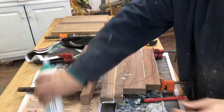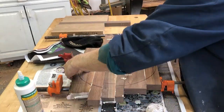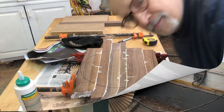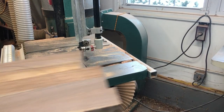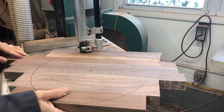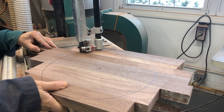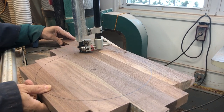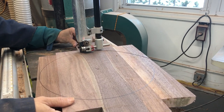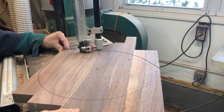I like using a lot of glue on this and I pre-drew the circle on top of the glued-up blank. From there I go over to the bandsaw the next day — always wait 24 hours after a glue-up — and cut out the initial shape. You don't really need a circle-cutting jig here; as long as I'm close it's not going to be a problem, because I'm going to put it on the lathe to get a nice profile on the top and bottom.